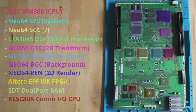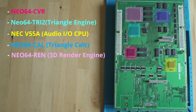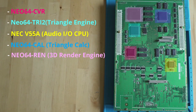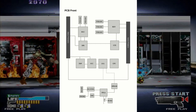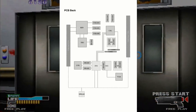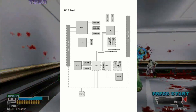If you take a look at the bottom of this system, that's where basically all the 3D hardware resides — triangle calculations, different 3D rendering engines, audio, as well as the IO CPU. Now, it's a lot of silicon to try to fit into the MiSTer FPGA, but at least we know the CPU side of things can work. I have an entire diagram made up of how all the chips talk to each other, with path tracing done with an engineer, so we know exactly how all the different chips talk, how the RAM works, and how things are loaded onto the silicon.